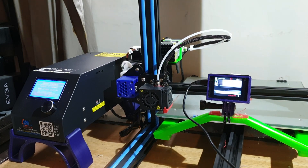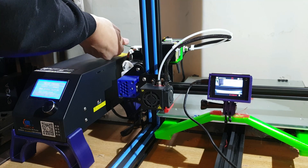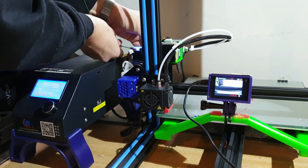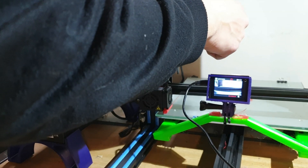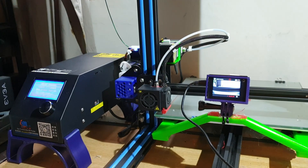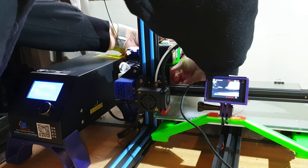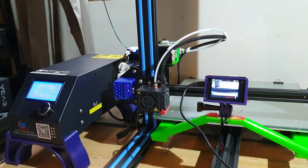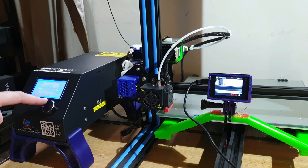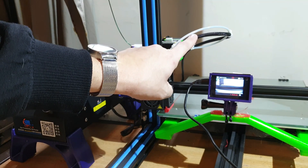Sorry about the banging noise - I put it in the front so I don't lose the end and get it wrapped up. The green one can be a bit tricky to feed in because of the new filament sensor - it can be a little awkward to feed through the Bowden. Feed it about halfway down the tube, don't feed it all the way to the end because the machine feeds it itself when it changes the filament. We do want to purge a little bit so there's no red left. Press the button on the control which says Insert Filament, press button to continue - now it's loading the filament.